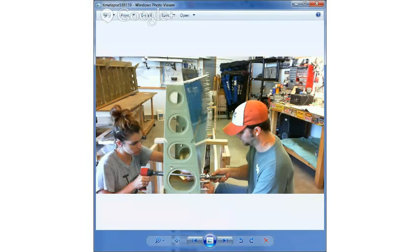But if you're going to rivet with two people and doing it back riveting, then I would have the less experienced person holding the bucking bar in this case. I never knew about the mushroom sets. I just saw that, Andy, in your chat window.